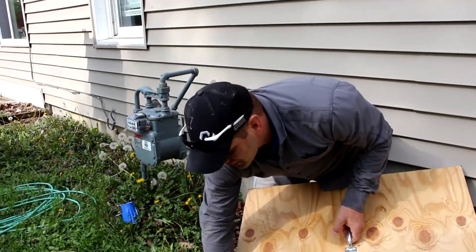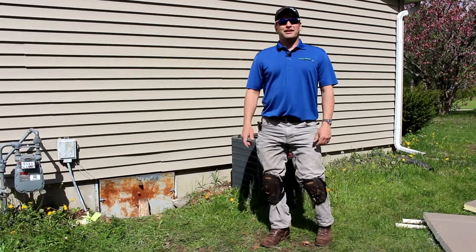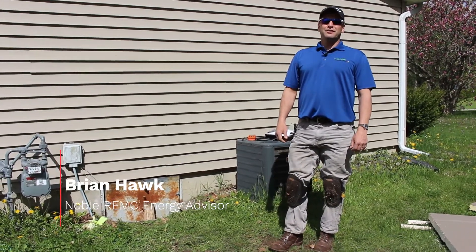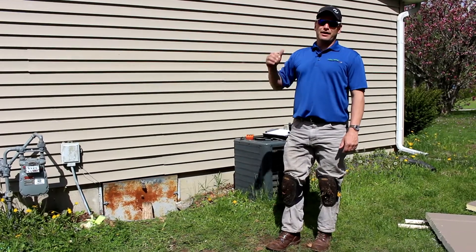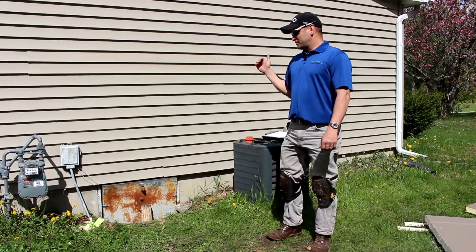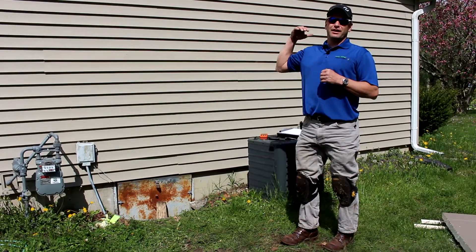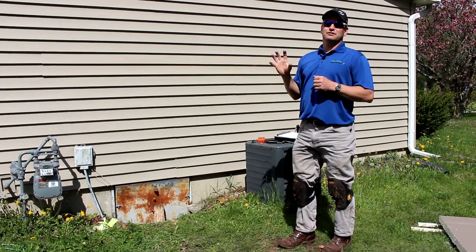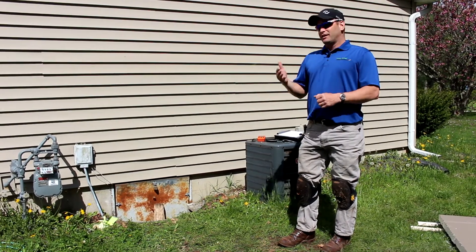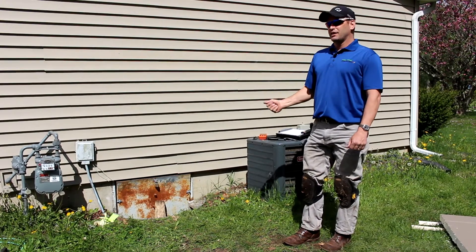This has got to be the coolest project I've ever done. Welcome back to Ask the Energy Advisor, I'm Brian Hawk, the energy advisor at Noble REMC. We've done a couple videos on air sealing. Today we're going to focus on the crawl space. When you think of your house as moving air through it, think of a chimney — the warmer the air gets, the higher it rises, the more it pressurizes and finds its way out, and in order to go out it has to bring air back in. Here's a prime example of where this house will be bringing cool air into the crawl space.